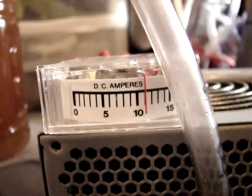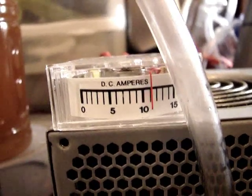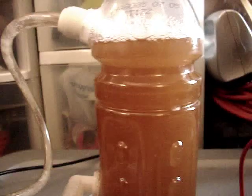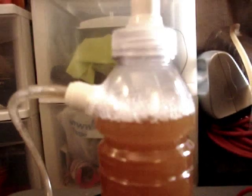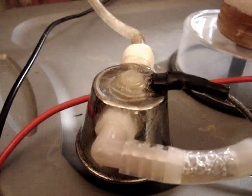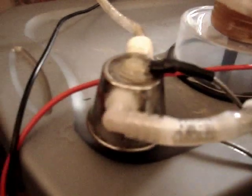Low amperage — we're running about 11 amps right now, and the only reason it's running at 11 amps is because I upped the electrolyte mix. I'm using two teaspoons of KOH, so it's definitely got an effect on it. The cell itself does get a little warm, but not too hot to the touch, which I'm amazed by. I guess maybe because of the circulation of the water from the refill, maybe it's keeping it cool. Also on my connectors, still cool to the touch.